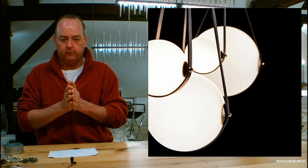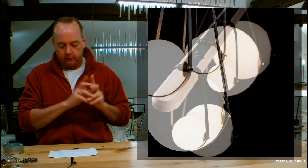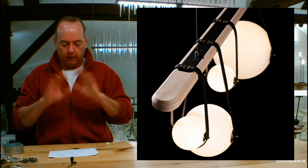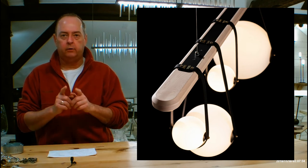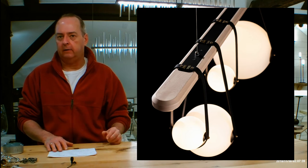This is a low voltage fixture. You're going to have two 2.8-watt pieces, one 3.8-watt, and one 5.8-watt — totaling 420 lumens all in. It's a dimmable fixture, so put it on a dimmer and tell your installer you're using LEDs so they put in the correct dimmer for LEDs.